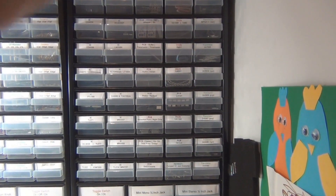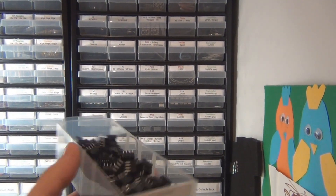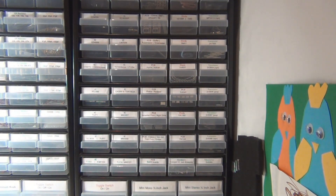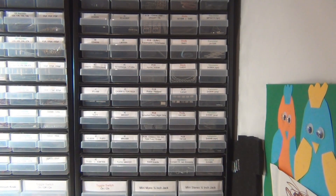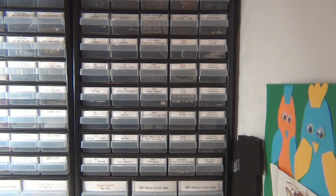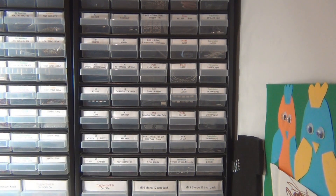It's also a good idea to stock up on some sockets. You've got different pin counts - 8-pin sockets are the ones you want to stock up on most, and then 14 and 16-pin you can get some of those as well for your ICs. Get some strips of single inline sockets too - you'll use those for transistors and things like that.